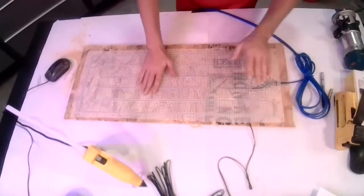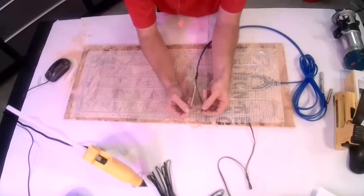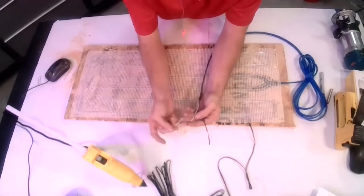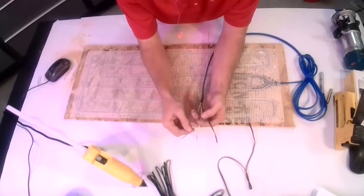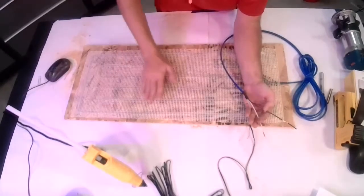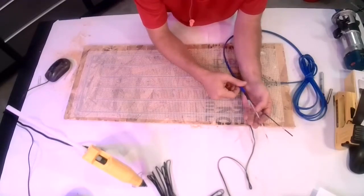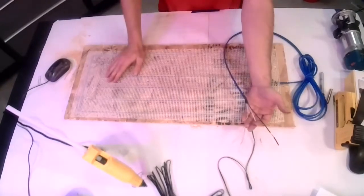One thing, which as I say that, I realize I don't have one sitting here, there is a device that is used when you are installing a Gold Heat system, not a black gold setup, called a loudmouth. What it allows you to do is clip onto your hot, neutral, and ground wires of your cold lead. You have that clipped on there and turned on the entire time you're working on the floor. What that does is if you did hit this wire with the staple and damage it, it's going to scream at you and let you know that there's something wrong. That way you can stop right then and fix it before you get the whole floor together and realize that it doesn't work.